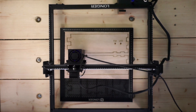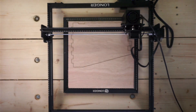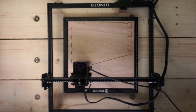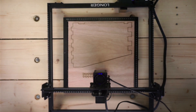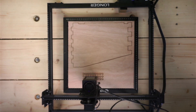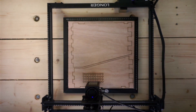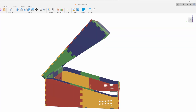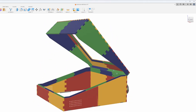Quick disclaimer: Longer have given me this product for free, but all opinions here are my own. This is 9mm hardwood ply from my local hardware shop — it's cutting perfectly with two passes at 200 millimeters per minute. If I was to use poplar ply it would cut much faster, like three times as fast, but I'm going to sacrifice the speed for harder wood and a cheaper price.